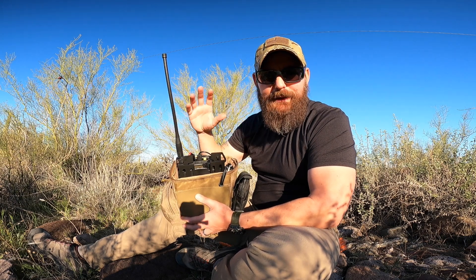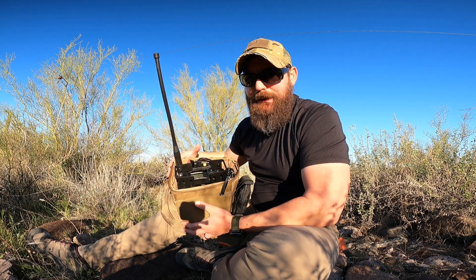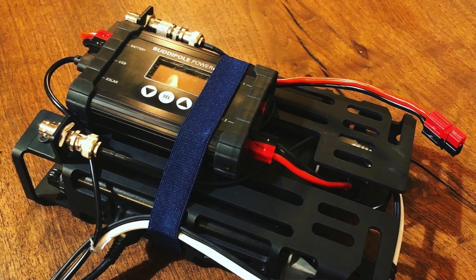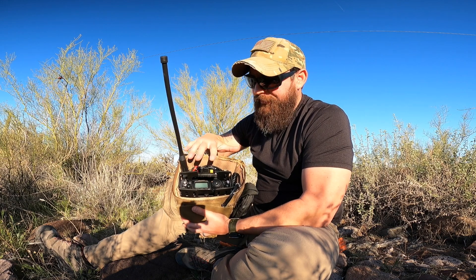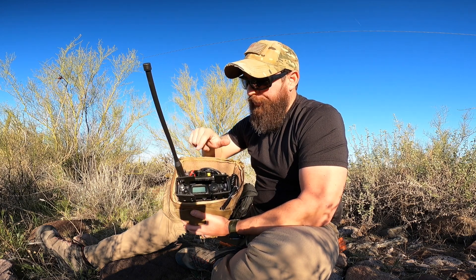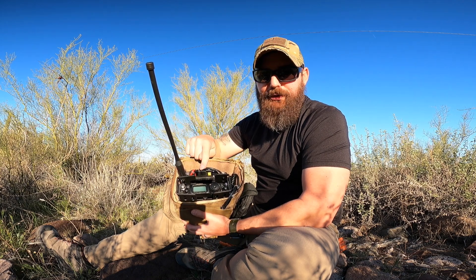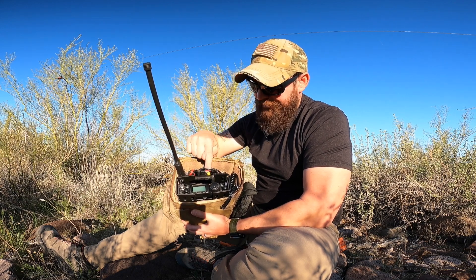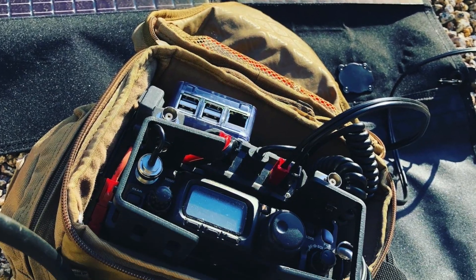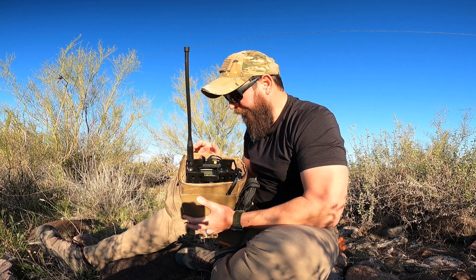In part three of this video, we're going to take the whole frame apart, walk through all the pieces, give you dimensions, weights, and how I'm connecting things. My entire kit is now built around the ArmorLock TPA817B. I even have power distribution with the BuddyPole Power Mini and a 4.5 amp-hour battery in the back. This is a solar charge controller first and foremost, providing power distribution for the entire system — two 12-volt outputs, I'm using one for the radio. I'm using the 5-volt USB out to power the Raspberry Pi. I also carry the 20-watt folding solar panel from PowerFilm and get about 800 milliamps out of that, which completely tops off this battery.